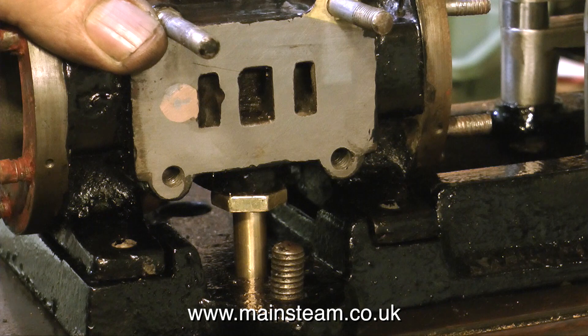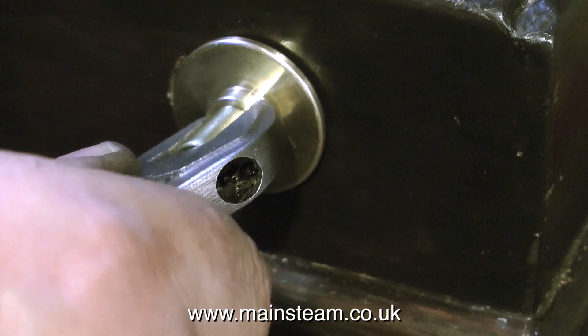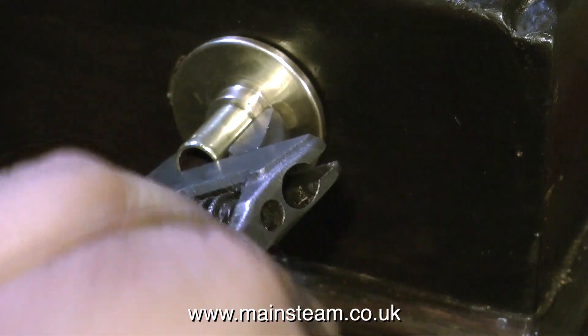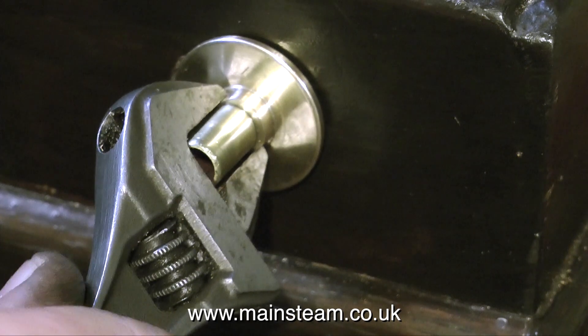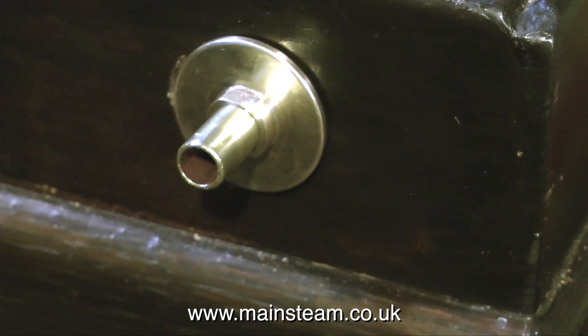The length of the tube from the bottom of the cylinder has to be quite exact to align with the horizontal piece of tubing. I made a simple flange for the exhaust pipe which is fastened to the pipe with some Loctite 603. Then I milled a couple of flat surfaces so I could use a spanner to screw the entire exhaust pipe into place.